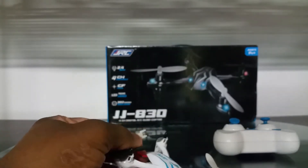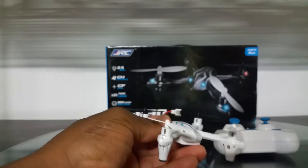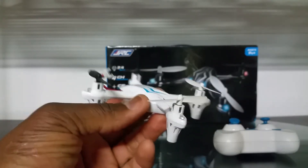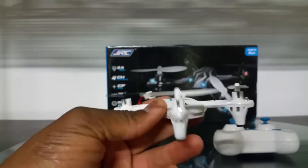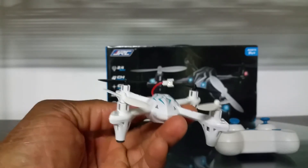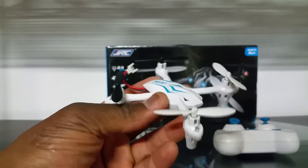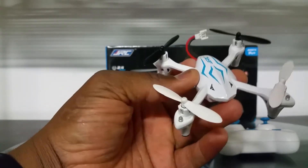It comes with a prop guard — I've misplaced it right now, but it'll probably be around if I do a full review. The prop guard doesn't really affect performance that much because the thing doesn't fly fast anyway, so it doesn't have a lot of pitch. With the prop guard on, it flies about the same as without. The difference is with flips — the quad seems to compensate for the weight of the prop guard, so flips are nicer with it on. Without the prop guard, it tends to elevate too much, which makes me think the programming was designed with the prop guard on. It's not really intended to be removed, but it is removable.